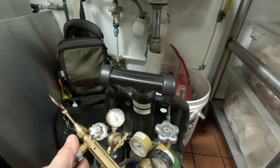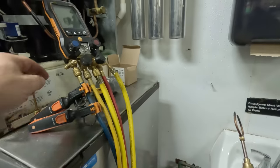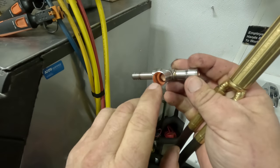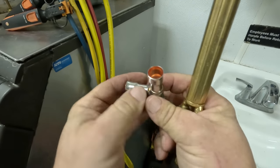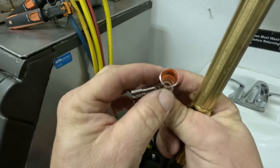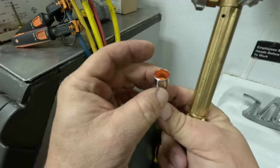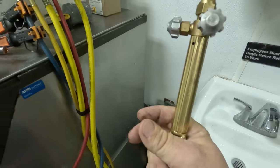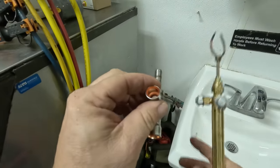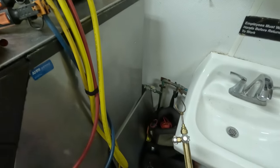Even though this is stainless on the outside, it's copper on the inside — this is not going to take much heat at all to warm up. You do not want to burn that copper coating off. You can use regular brazing alloy for this. Keep that in mind. We're probably going to have to keep this thing wet — it definitely wouldn't be a bad idea — or get on and get off as fast as possible.